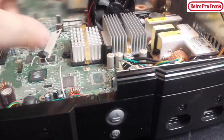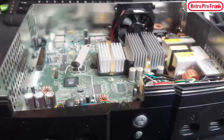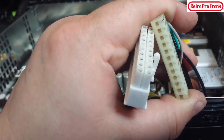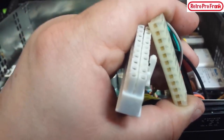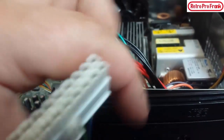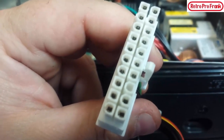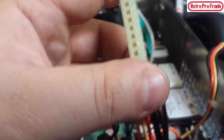Today I'm going to replace the capacitors, remove the whole board, clean the fan, and I'd like to do a case mod — maybe put a window where you can see the CD spinning, which will involve cutting the case with a Dremel. Now I got the power board unplugged. The one on the right is the version 1.0 and 1.1 style — just an old power supply like out of a Pentium 4. The one on the left is what any other version looks like — it has a double row connector, so if your Xbox has a double row it's a version 1.3, 1.4, 1.5, or 1.6.